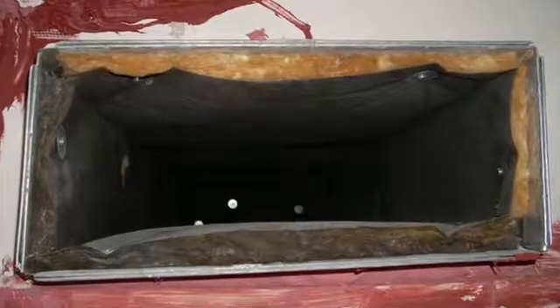Number five, install the sealant. Sealant must be in the plane of the wall or floor completely and fill the annular space. Firestop material just smeared on the surface or piled up across the face of the opening will fail inspection and will fail during a fire.